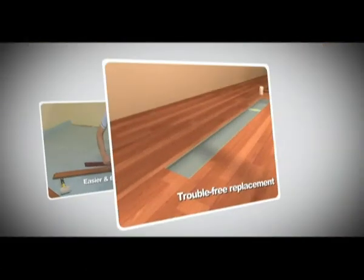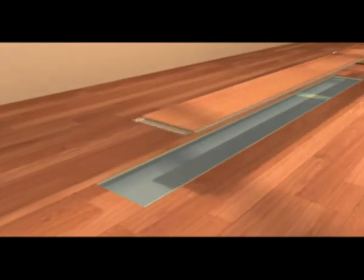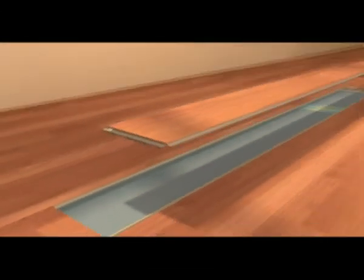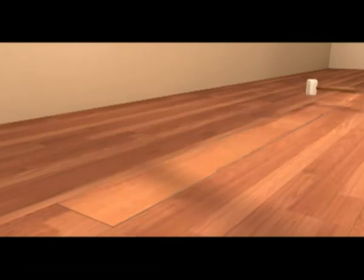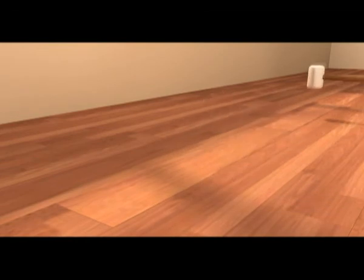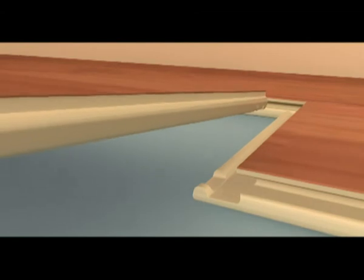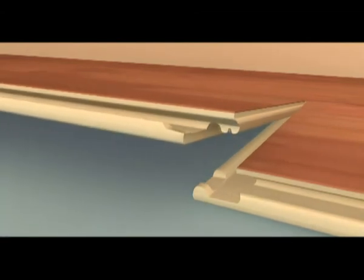9. Trouble-free replacement. Where one panel in the middle area is broken, Tap & Go offers you an easier way to replace it. After fetching out the broken one with special equipment, take a new panel, then you just need to saw off the short side low hook and install it conversely. The remaining three sides of the hook can also lock the floor with others firmly.